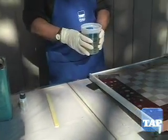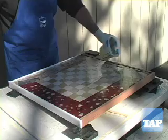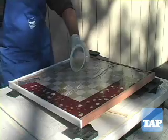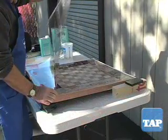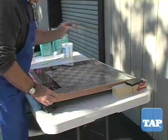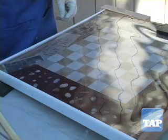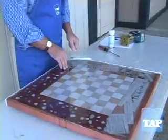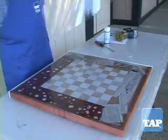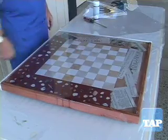We will mix up a fourth batch of resin and catalyst and pour it on. The resin does not self-level, so you may have to move it around. Wait a few minutes for any bubbles to surface and pop. Then, lay a piece of 5 mil or thicker Mylar on the wet resin, being careful not to trap any bubbles. This can be challenging. We then wait for the resin to cure. When cured, the Mylar is easily removed, leaving a glass smooth surface.